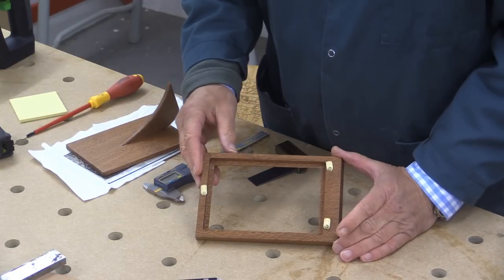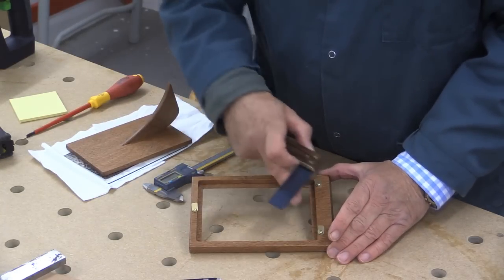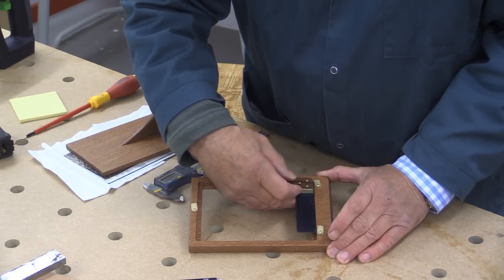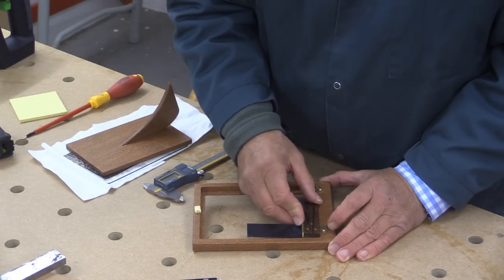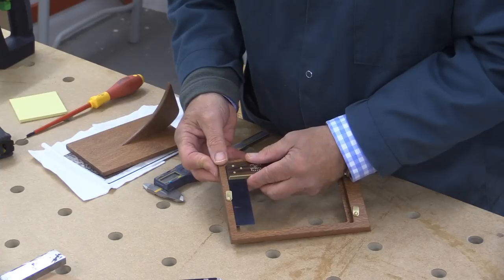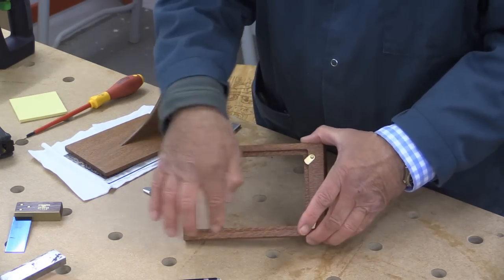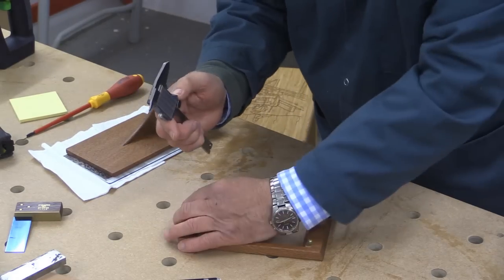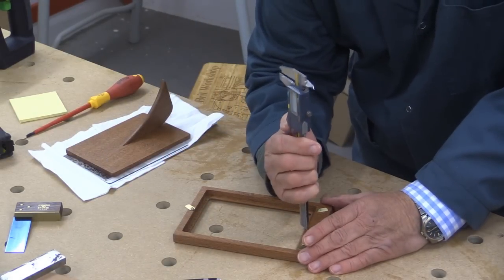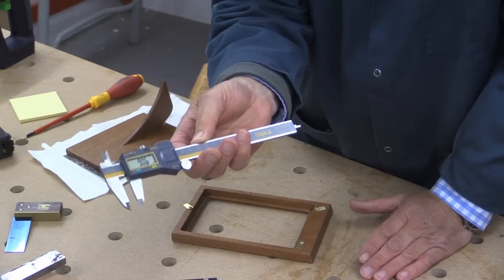This is a really important step — to check the accuracy of the manufacture of this item. I'm going to start by checking to see how square the apertures are. As far as I'm concerned that is as good as anything needs to be. I've rounded off this corner so that it will fit into that rounded corner. I'm happy about the squareness. Now the depth of this rebate which I've done all the way around — measuring at the two ends: just there it's 9.1, and just here it's 9.06. And now you understand why I'm so happy with the X-Carve.